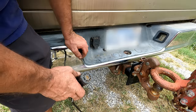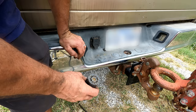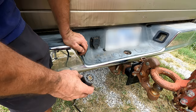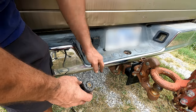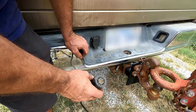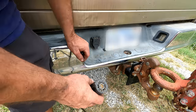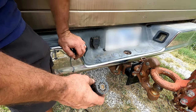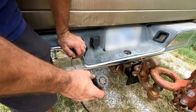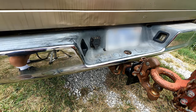I didn't have a ground there. It seems like, oh, it was probably just these, but I really don't think it was, because I was testing it pretty well. You know, sometimes when you're testing with a meter and you're holding it against the bolt and it's like, oh, I don't have a ground. Well, it's actually that where you're holding it against the bolt is not a ground. But I definitely had grounds here, and I did not have one in the receptacle there. So I think I had two problems, but they're fixed. There's more to do, though.